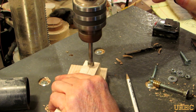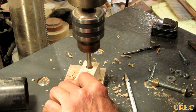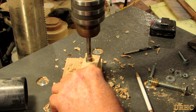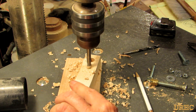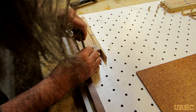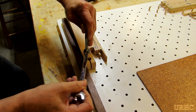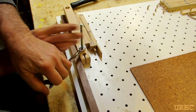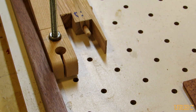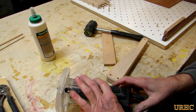Once I got that trimmed up, I drilled two half-inch holes for the other stops. The first one near the edge will have a split clamp on it to hold an easily adjustable stop, and the second one gets a threaded insert for a carriage bolt as a fine-adjust clamp. To install the inserts, I screw a piece of threaded rod into the insert and use a nut and wrench to drive it into the ash, since they take a little force. Once it's in, you back the nut off and unthread the rod — the insert stays in place, and the long shaft helps keep it aligned straight.